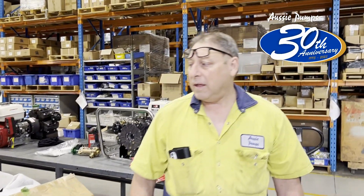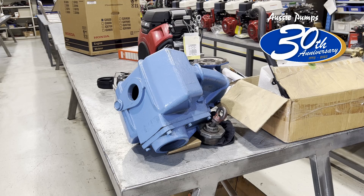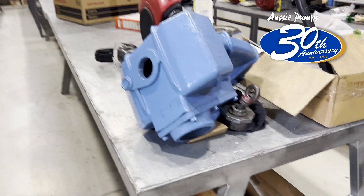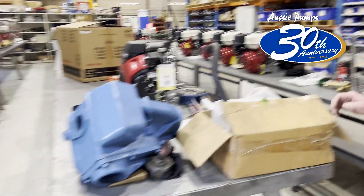It's a unique performance — ideal for farmers wanting to move a lot of water up a hill. The guys using this are doing serious high pressure work, moving water to the top of a hill, and in some cases even using it for firefighting. We've got bronze ones coming out of the foundry soon — they're going on tugs for putting out fires. The users like the idea of it being self-priming.